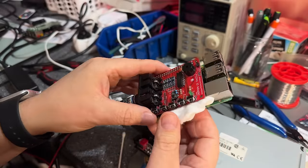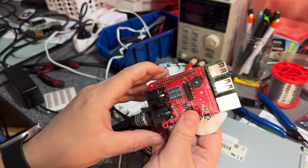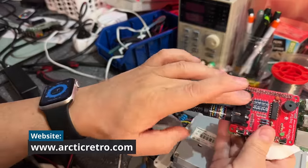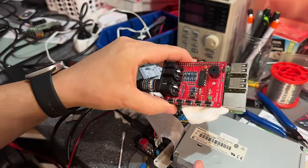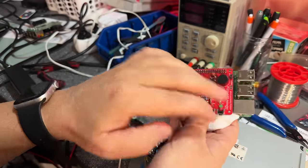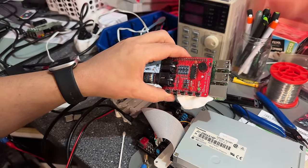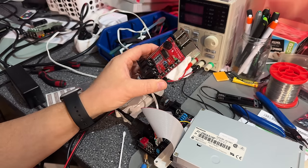There are several different options. You have devices like the PI1541, which actually supports 1581 or D81 floppy disk images. So you could connect the cable from this through the 1581 drive and then to your Commodore, mount up a D81 disk image, and simply copy the whole disk to a real floppy. But first you need to load a copier program that supports 1581 disk copy.